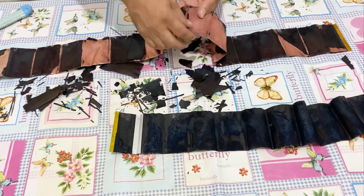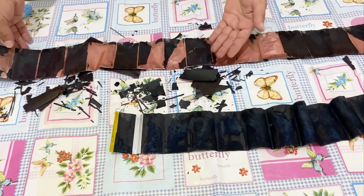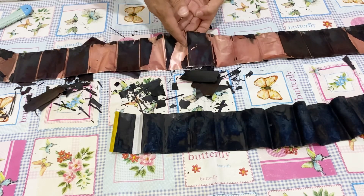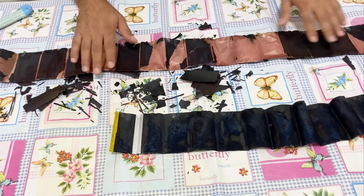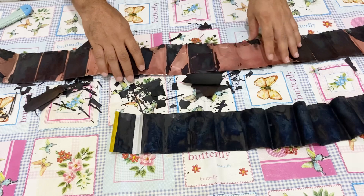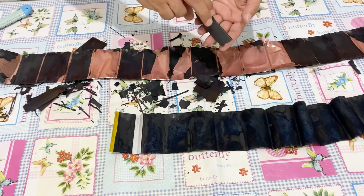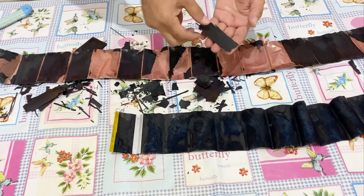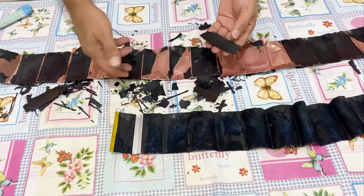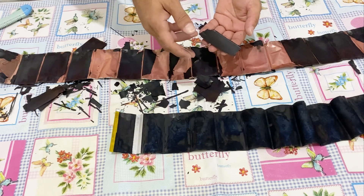We can easily remove the graphite from the copper foil. So if this copper foil were in good shape, would it be possible to make a supercapacitor from it — for example, if you cut it into two pieces, put two separators between those plates and rolled it up? The answer is no, for two reasons. The first reason is that this material does not have a large surface area. This is graphite — it is not activated carbon or graphene, and there is some carbon black inside. The surface area is very low, so you cannot use this material to make a supercapacitor. If you did, the capacitance would be only about 0.5 farad, which is very low for a supercapacitor.